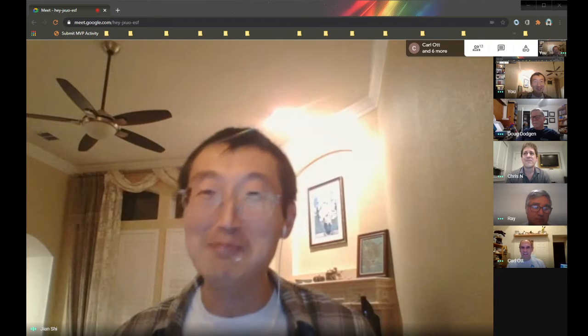how much data do you have, right? Because if you're running a controller at, let's say, 50 hertz, you said something about 10,000 bytes per second, right? That means you can do 200 bytes every iteration of the control loop. Yeah. Well, unless you have something like LiDAR or a camera, what do you need 200 bytes for, right? I mean, I'm not really doing feedback.